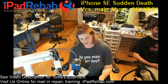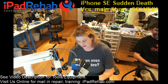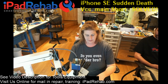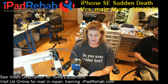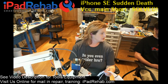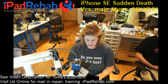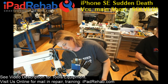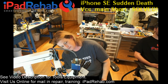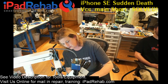All right, so this is Apple logo boot loop. That means it needs to get an update, which is really not atypical. But before I can do that, I'm going to have to change TriStar in case of heat next to TriStar, which it doesn't look like it has any, but would you change TriStar before updating it? We'll go with yeah. Yes. I would too, that would be silly not to. Alrighty. So it has a pretty classic looking TriStar boot loop.